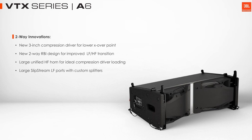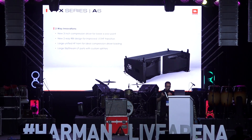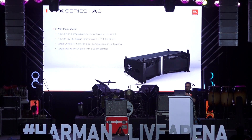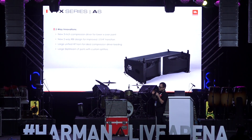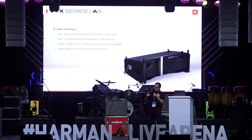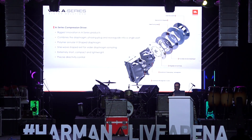It's a two-way system with a new RBI — RBI is the horn technology that we have. You can see some of the plastic parts in front of the woofers; that is what we call an RBI, and that's new for the A6. We have new woofers and new ports. The point is that the A6 was developed from the ground up, from brand new transducers and brand new acoustic design — there was no reuse from our existing catalogue. It was a big project and everything was designed specifically for the A6.